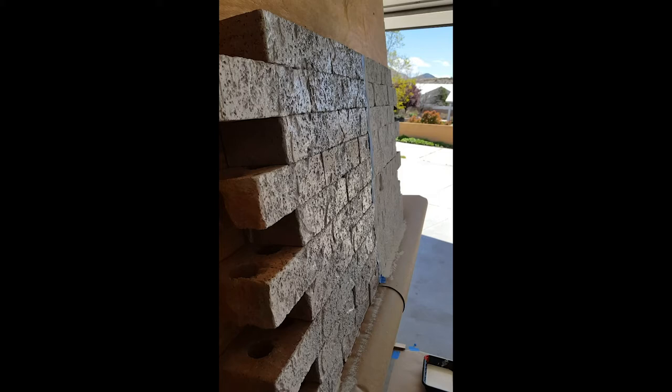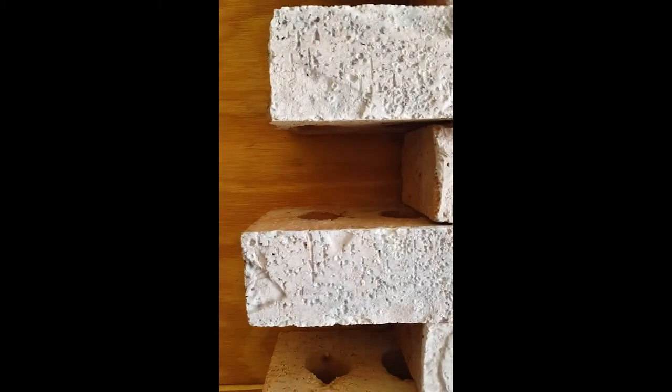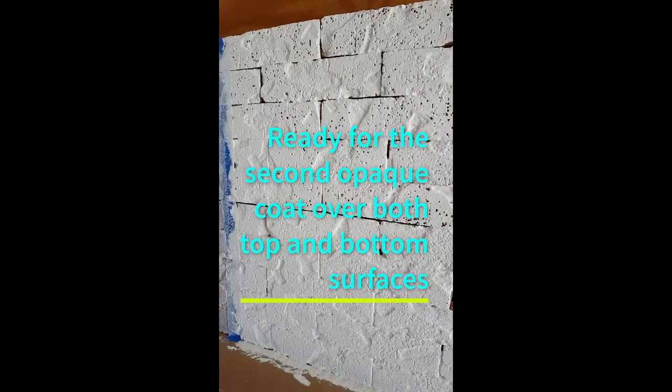Notice that the marks from the roller have disappeared. We now see a more even appearance. Remember that the brick is still wet — once the coating dries, we're going to see much more opacity as it builds up. Some of these other areas are going to be a bit wider, lighter in color, more hiding once this cures out. We finished the concrete stone glaze application — the second coat is on. We're now going to apply the second coat to our opaque side.